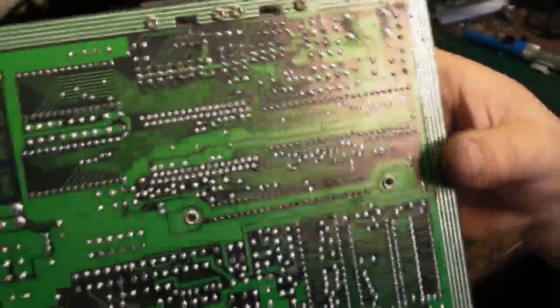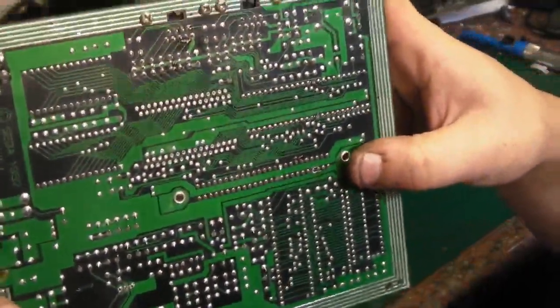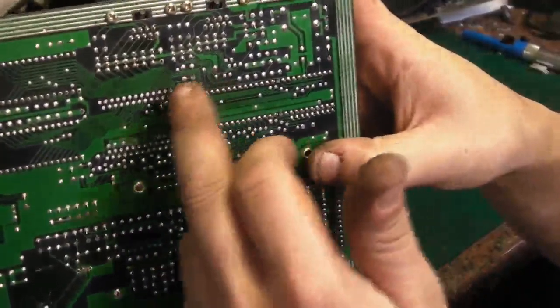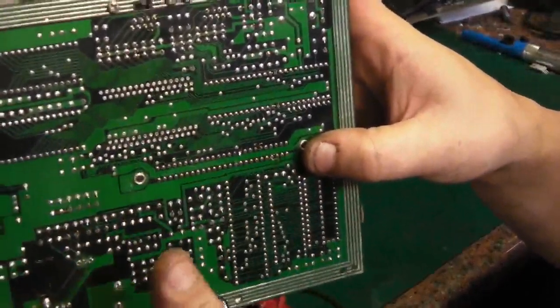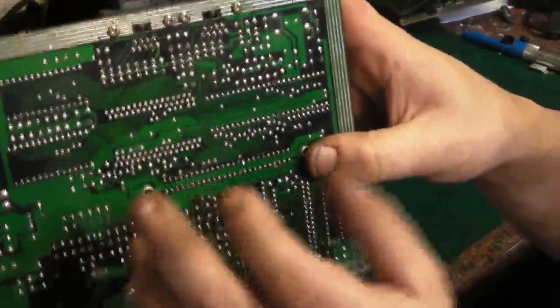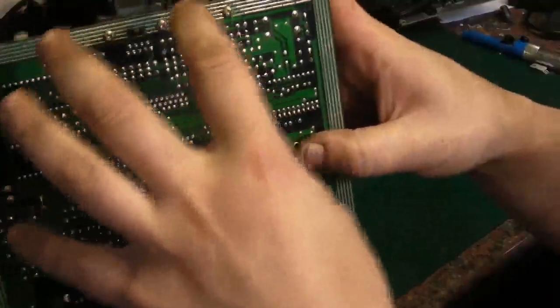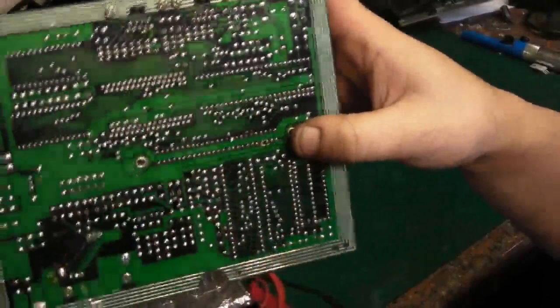If you've seen Gadget's video, it's on a NES that he's working on. The guy sends him a spare board that he's already extracted a few chips off. And you can see around here, it's all basically swelled up and bulged where it's made the PCB material start to delaminate, and that is purely because they've just blasted the whole area with heat until it's got hot enough to melt the solder and actually pulled the IC off.